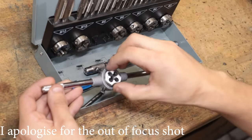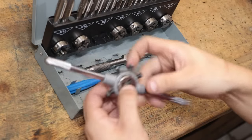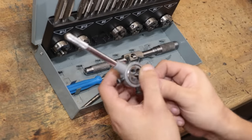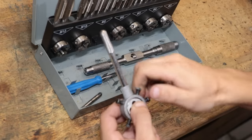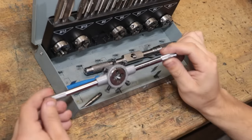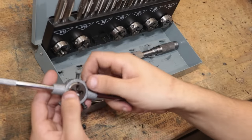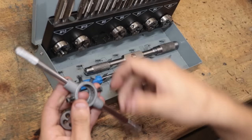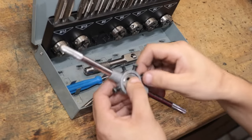The reason comes down to the screws. There's five of them which match up with the dimples in the button die, and that's all fine, except for the fact that I never use them. At most I only use three. But that's not the problem. The problem is when it comes to taking out the screws, you never know which one is still engaged, and as a result I always end up unscrewing one too far and it drops on the floor never to be seen again. Without fail, this happens pretty much every time I use the die holder, and honestly it is a bit of a pain.